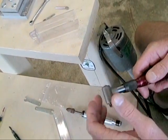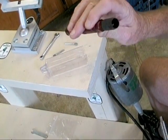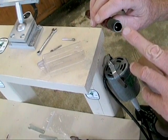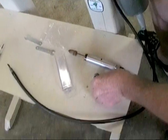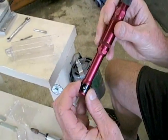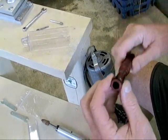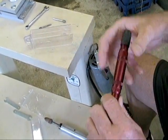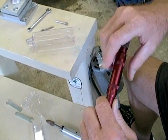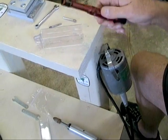To disassemble the 1MC, just loosen your knurled nut — this pulls apart from the body. The body's only got your inner shaft and one bearing in here. If you do need to break it apart, put it in a vise or in your lathe. Don't squish it, because if you oblong this, nothing's going to connect. Then just take a wrench — it's got little facets on there that you can put a wrench straight on. It's real simple.